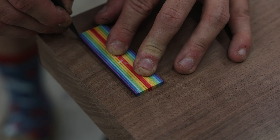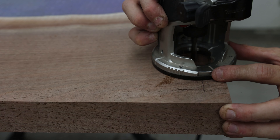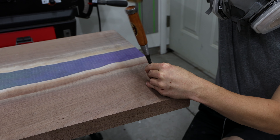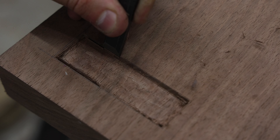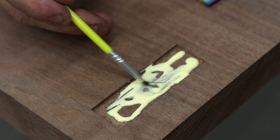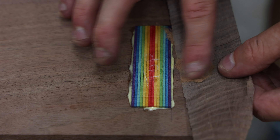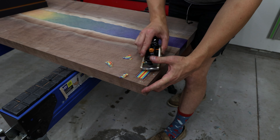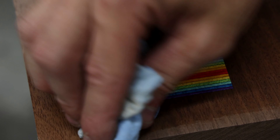If you'd like to show your support for my creative endeavor, subscribing to this channel and sharing this video are worth more to me than you can imagine. Now, back to this logo tag. After bookmatching the rainbow veneer, drum sanding it flat, squaring it off to three inches length, and routing a recess for it, I chisel the remaining material to the line established with a marking knife. I take care to remove only small bits of material at a time so that I don't crush the grain, creating a gap outside of the inlay. Off camera, I sanded an offcut from the slab to get dust that would match the color, then spread that along the outline of the inlay while gluing up to ensure any potential gaps are filled. Once the glue is set, I use a hand plane to take off the excess material that's proud of the surface, then hit it with 120 grit to see how I did with the chisel work. A little water pop to show off the colors, and I'm pretty pumped with that result.